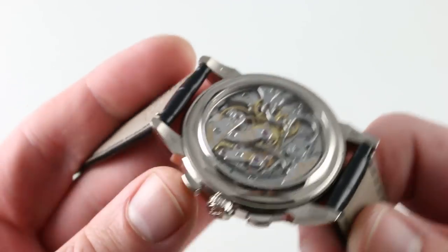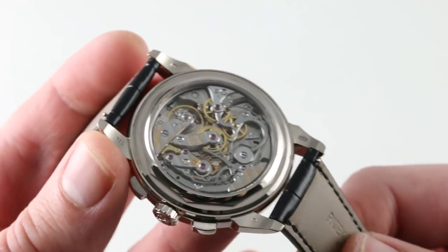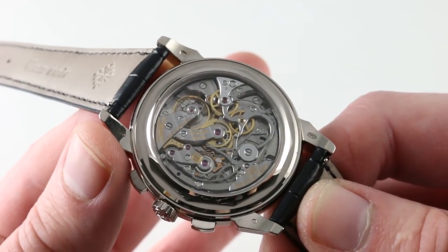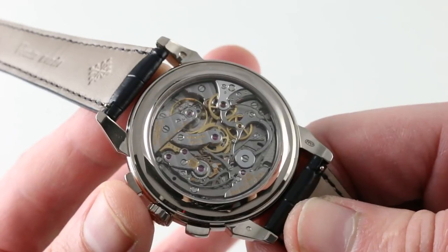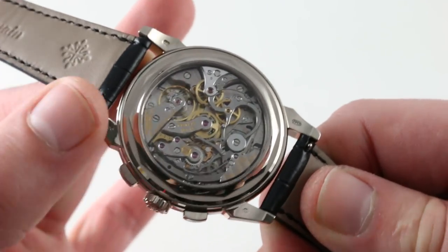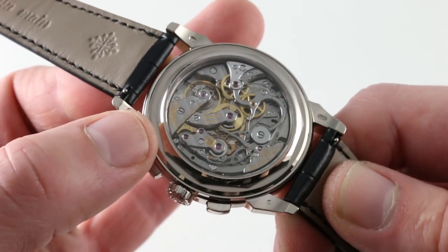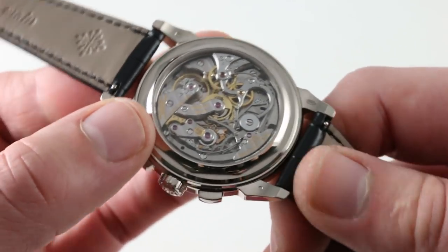Turn the watch over and you get a look at the caliber 29-535 PSQ — a perpetual calendar, column-wheel chronograph executed to the finest standards of Geneva watchmaking. It's bigger than the previous LeCoultre-based CH 27-70: this is a 29-millimeter movement versus the prior 27mm, so it better fills out the case back. It beats at 28,800 vibrations per hour rather than the stately 18,000 of its predecessor. It still uses a Breguet overcoil hairspring with a ferrous composition — not silicon — the overcoil enabling the watch to resist positional and gravitationally induced timing deviation. Patek's double-screwed Geneva stud holder and free-sprung index support the Gyromax-style balance, enabling precise regulation that holds in the face of bumps, vibration, and concussion on the wrist.